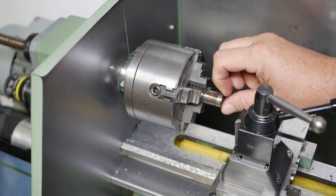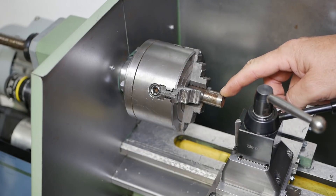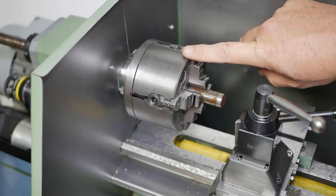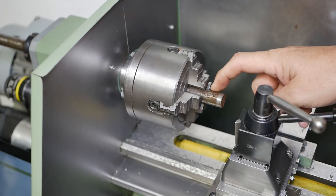So far I just did this little test cut on the end — doesn't seem that nice to cut but we'll see if the little lathe can do it. I've set it up in the four-jaw; it doesn't need to be a four-jaw except my four-jaw chuck's a little bigger, it's got a bigger through hole and this bar fits through it. The three-jaw doesn't fit a 17mm bar, and the part I'm making needs to be 16mm so I just need to take a millimetre off the outside.